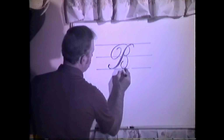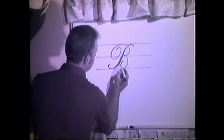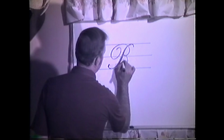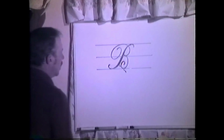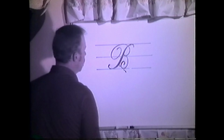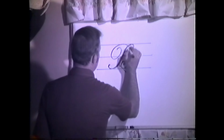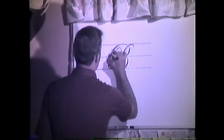The roundness of your letters must be smooth arcs. There's a little flaw, not hardly visible, but it's a little flat spot on that. So these, you have to pay particular attention to the roundness of your arc, script lettering also. Some of that'll get ironed out in the cutting. It's harder to draw it than it is to cut it once you become accomplished with the tools. Anyone who can cut well can execute good letters once they understand the letters, can construct the designing of them.